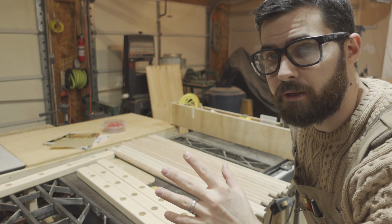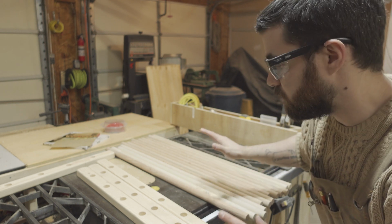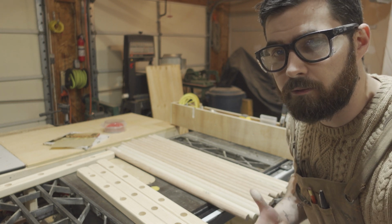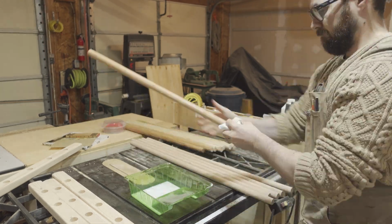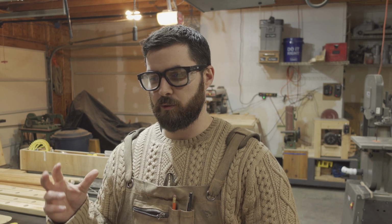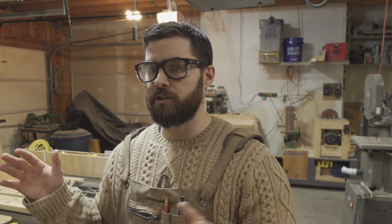While that one dries, I'm now ready to do a quick wipe down of all of these pieces with some mineral spirits. Once that is all set, I can then put a coat of boiled linseed oil on and it will adequately soak in. I just finished cleaning all of the pieces with some mineral spirits. I think a better course of action now would be to assemble the 2 legs by gluing the dowels in place, giving that some time to set, and then I will apply boiled linseed oil.